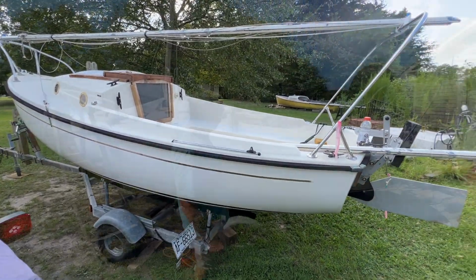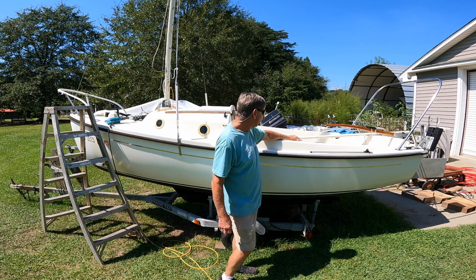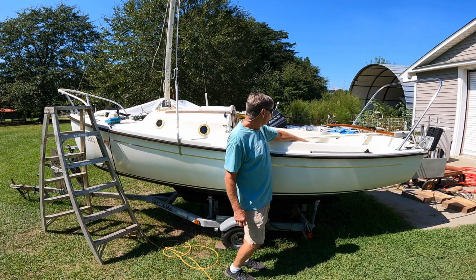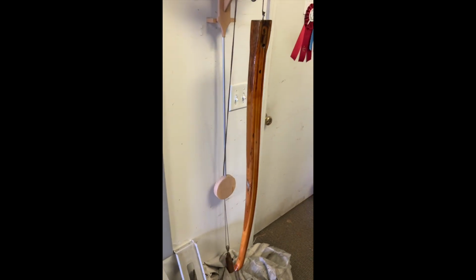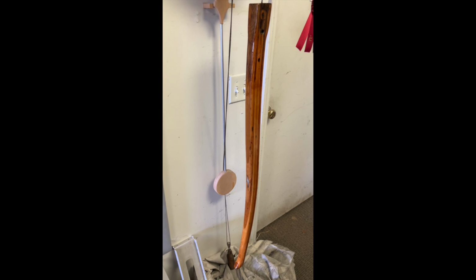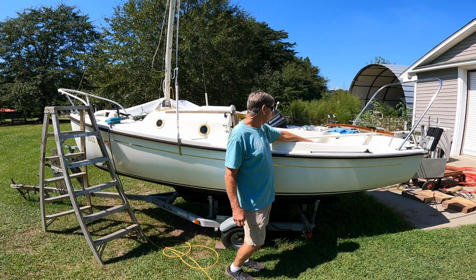That's that same boat. I had a second-hand tiller from another boat where I had put a new one on. This one had partially delaminated. Took it apart and glued it back together with epoxy, and it's just got one coat of varnish on it. I'll put several more coats of varnish on it, but I just wanted to get it on the boat because I'm going to see if I can maybe take it sailing, see what I've got. Got the tiller doctored up and sanded out and epoxy resin coated, saturated, sanded out again, de-waxed, and first coat of varnish on it using exterior spar varnish. Like I said, that still needs at least 3 or 4 more coats of varnish on it.